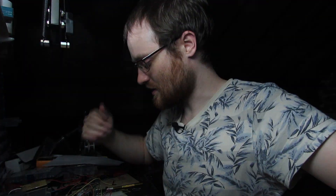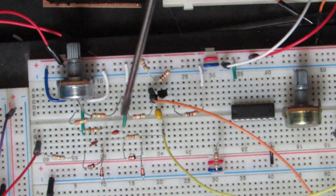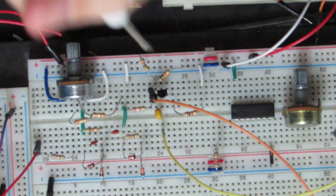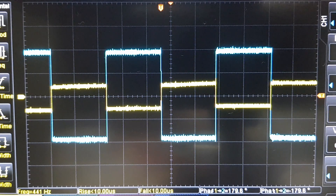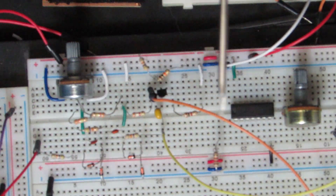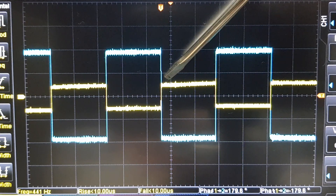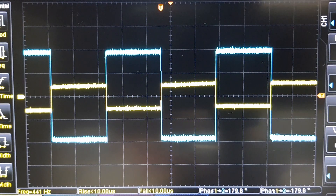Let's go have a look at it working. Here's the circuit on the breadboard — this is the filter section, and this is the transistor amplifier. There's the bias network, the emitter resistor at 1k, and the collector resistor at 3.9k, with 10k and 47k for the bias divider. Looking at the oscilloscope, we're looking at the voltage on the base and the voltage at the collector. A half-volt increase at the base causes the emitter resistor voltage to go up by half a volt, increasing the current through the emitter and hence the collector resistor. Since the collector resistor is four times bigger, the voltage drop is four times bigger — so half a volt at the base gives two volts change at the collector output.